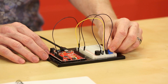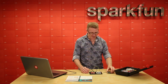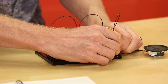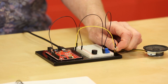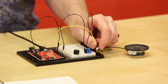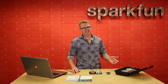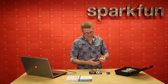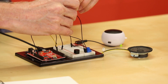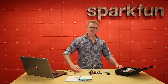If it seems a little quiet, make sure your potentiometer is adjusted all the way to one end — that will give you the loudest volume you can get out of your little buzzer. But what if you want it louder? You could grab an old speaker you may have laying around and wire into that — that should give you a little more volume. So that was louder, but what if it's not loud enough still? What if you live alone or want to? You could even add a powered speaker like this one. Run your wiring here — it's almost like a symphony in your own house.